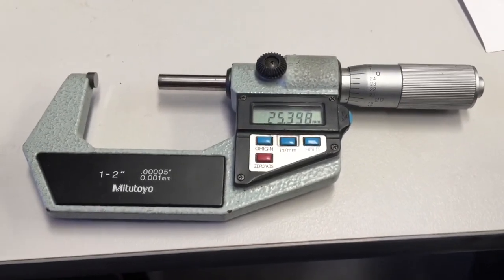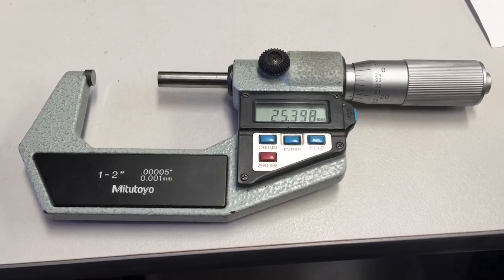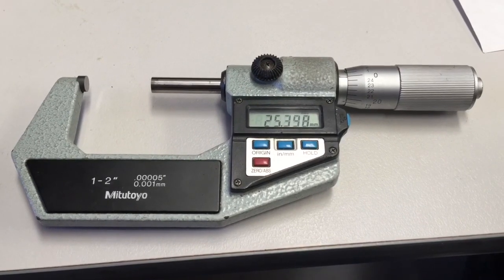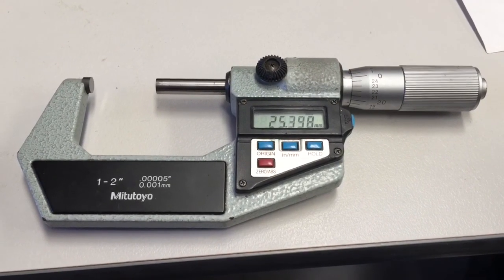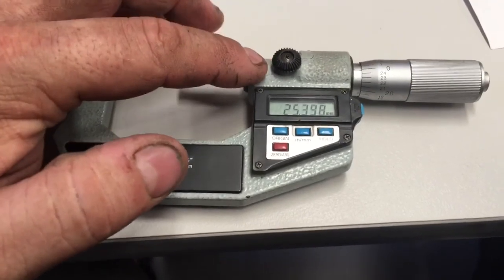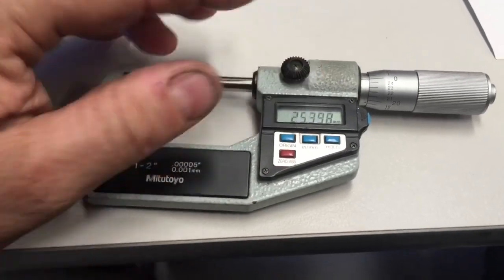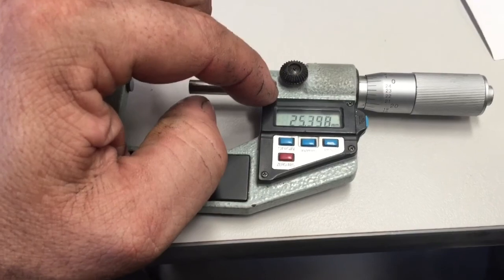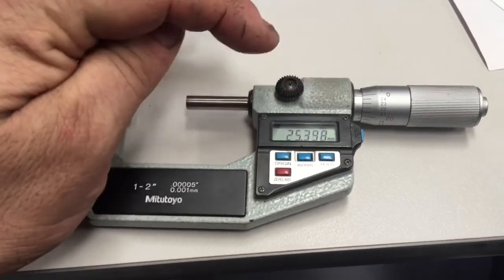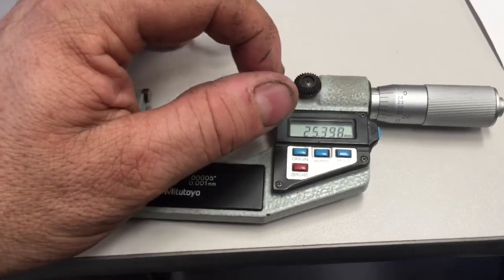But other than that, E05 certainly seems to be partially caused by the encoder disc being allowed to come off the face of the sensor rim. The adjustment for it involves tweaking the two flat screws inside. One is a spring mounted collar, so you release the clamp on the spring mounted collar, which is on the anvil end, which frees up the spring mounted collar to push against the other end. As you lock up this end, if it's too tight, then you'll have difficulty turning. If it's too loose, then your encoder won't be held above. So it's a matter of just tweaking those so that you've got enough preload set by the spring and then just released if you need to.